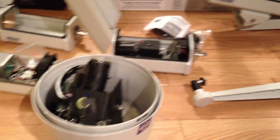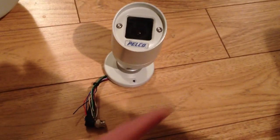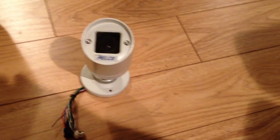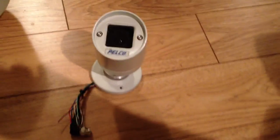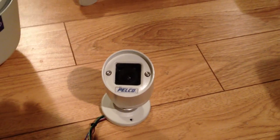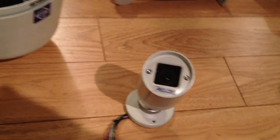If you don't want a camera-housing combination, you can do an all-in-one type — they have the Cam Closure series. This is an ICS-300 series camera; there's the ICS-200, which is the little triangular wedge-style, and the ICS-110 and Cam Closure 2, and other dome-style ones. If you're going to put it outside, I highly recommend a true day/night camera that snaps into black and white during night hours so you get good video resolution.